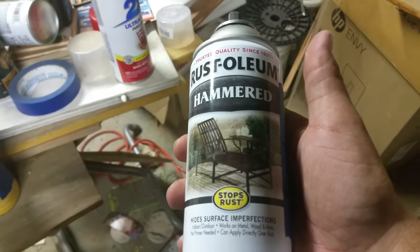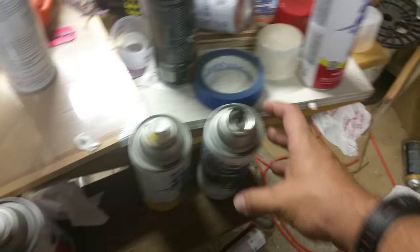I'm sitting right about 10 milliamps at 350 millimeters per second speed. It takes about three minutes and change per dog tag. Once I get it engraved like this, I take the dog tag with the engraving area open — since it engraves right through the tape — and just put a quick spray coat of hammered black Rust-Oleum over it.